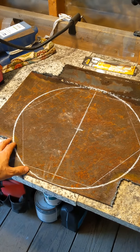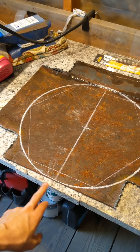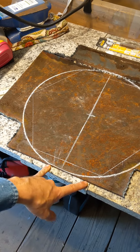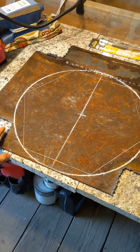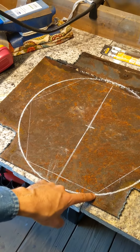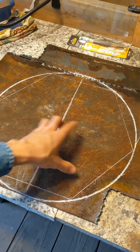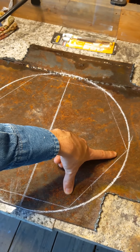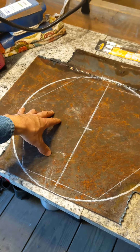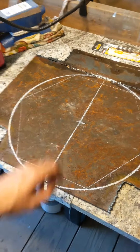What I did here was draw a circle the size of the grill I have, then took a straight line off of it with the t-square. I lucked out because hexagons are actually pretty easy to draw — the width from one vertex to an opposing vertex was 16, and the side lengths are all half of that, which is 8, because a hexagon is made up of six equilateral triangles.